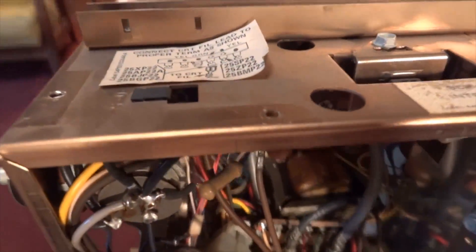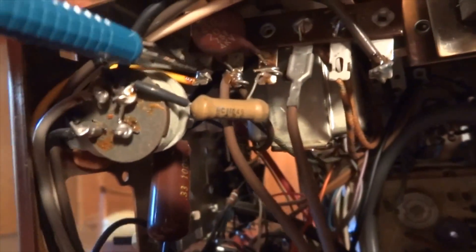Here's a look at the location of that 770-ohm resistor and the power switch. Right here is the 770-ohm resistor — they mounted it to the top of the chassis for a heat sink. Here's the interlock; since it works in the drawer, it's got two sets of interlocks, one behind the set and one right here. A black wire comes out of the interlock and goes directly to the power switch. From the power switch, it feeds this resistor, and then it goes to this terminal block, which you can see via this yellow wire.